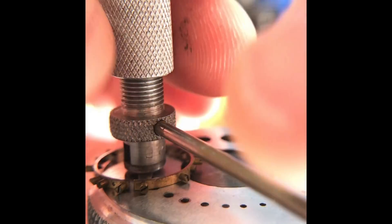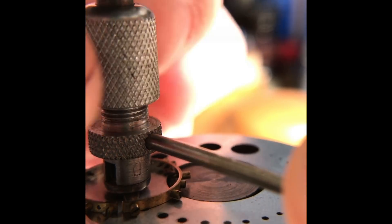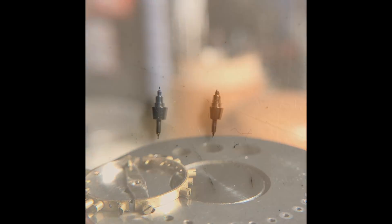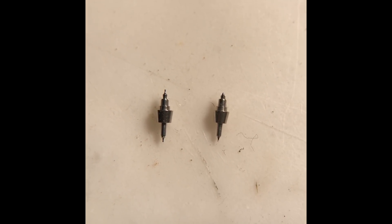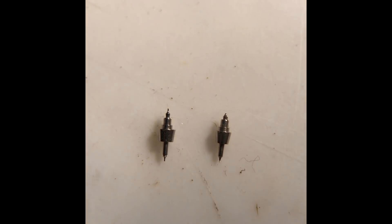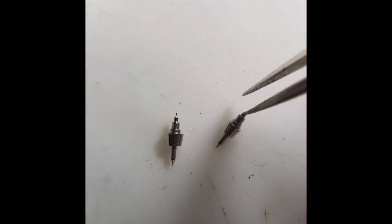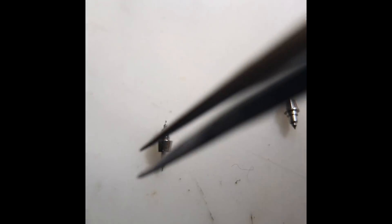The staff is caught on the magnet. Now loosen the tool, remove the punch and the tool. I can visually identify that these two staffs are indeed the same. It looks like during the removal process I just broke the tip of the top one off. You can see the bent one on the bottom — this is the old one, and that is the new one.